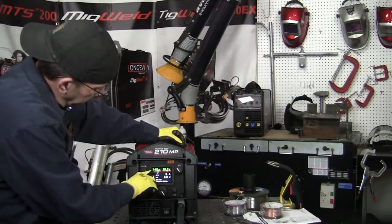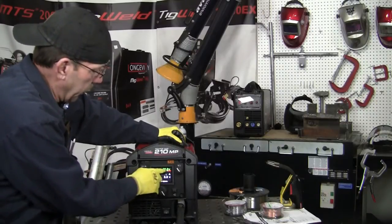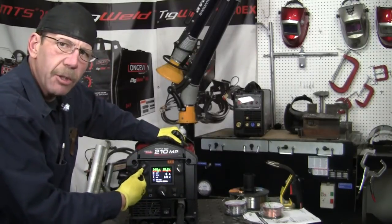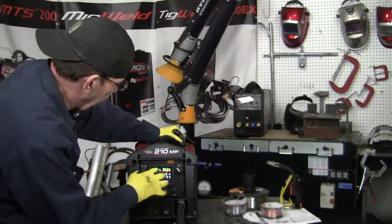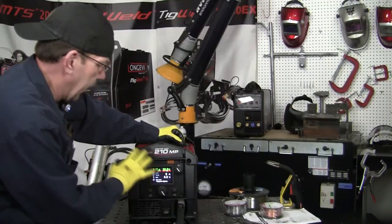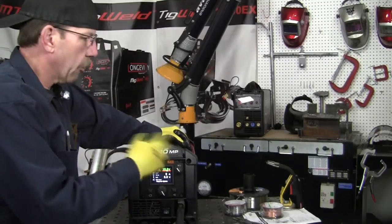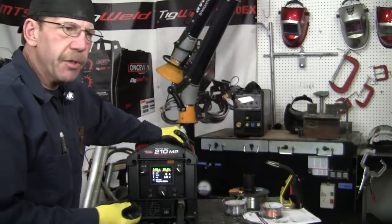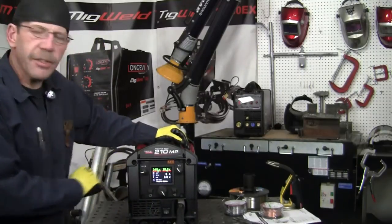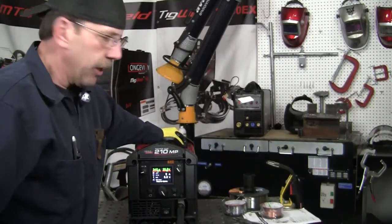If you can see it, on both sides there'll be a red and green line. The green in the middle of those red lines keeps you in where you want to be — then it's up to you and how comfortable you want it. I've got it set up already pretty much where I want to keep it for our material, so we're good to go. There's also another option setting where you can go past that if you want to use a different gas, thicker wire, or another kind of material. But for our purposes we're going to stay with mild steel eighth-of-an-inch thick.